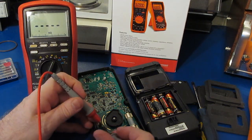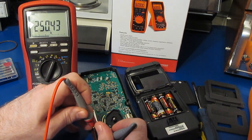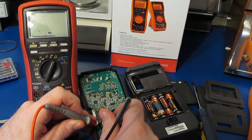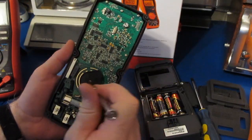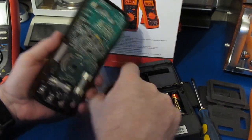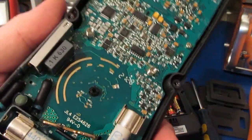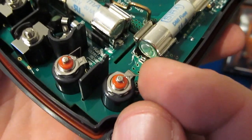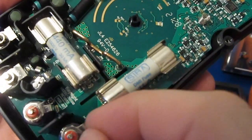Normally I'd expect these PTCs to be about 1.3K or so; you can see in-circuit it measures about 790 ohms. The surge-rated resistors are also typically about 1K ohm, and here we can see in-circuit they're measuring about 250 — about 270 ohms on the other side. I'm curious about the detent spring, so let's finish taking this apart. You can see the contacts with a lot of spacing; to pop these out we just push the spring forward.